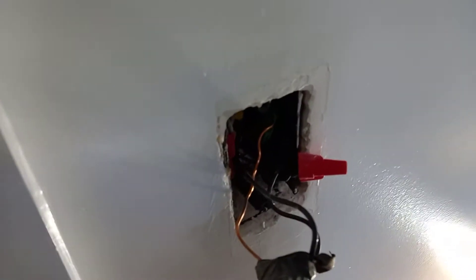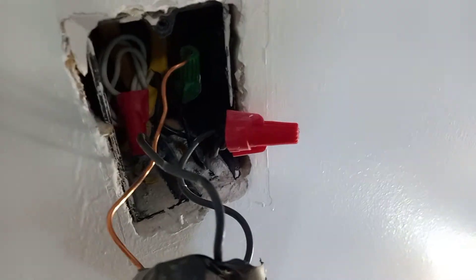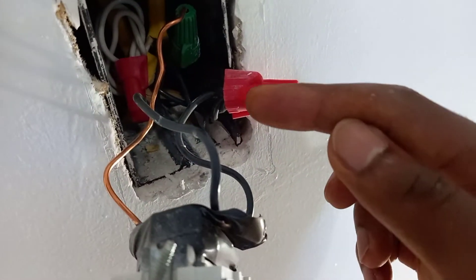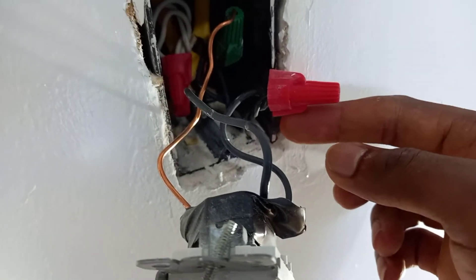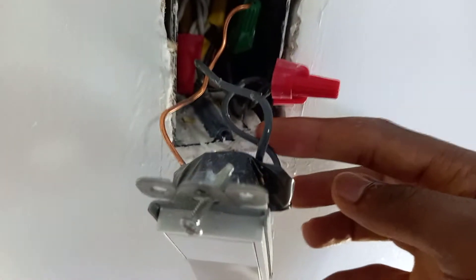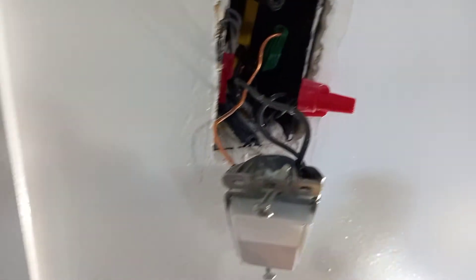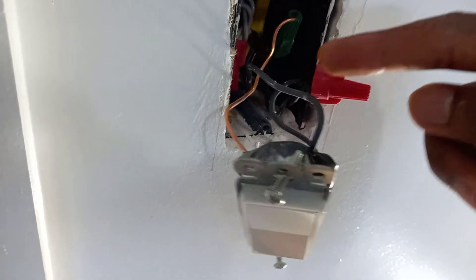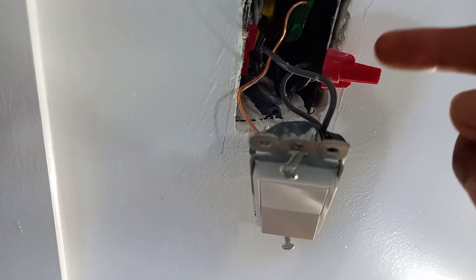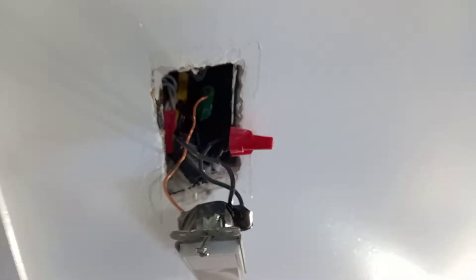To do that we need to remove these wires here. As you can see, this wire that comes from the outlet goes straight to this wire nut, and from this wire nut there are three wires. The one that goes to the outlet, the next one goes to the lights on the roof right there, and the third wire is the feed that comes to the switch. So we're going to take out the wire that goes to the outlet, put it together with the hot, and put the feed wire to the switch. The wire that goes to the light will be alone on the other leg of the switch.